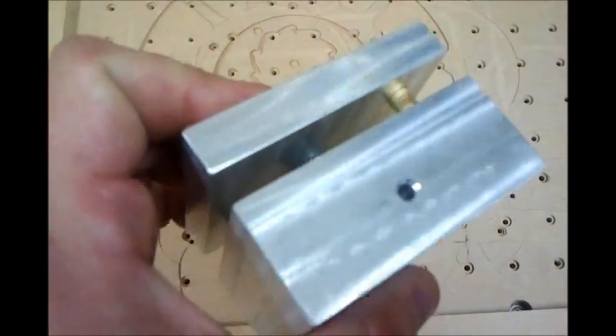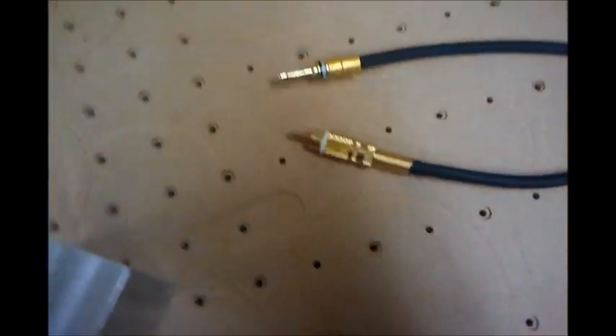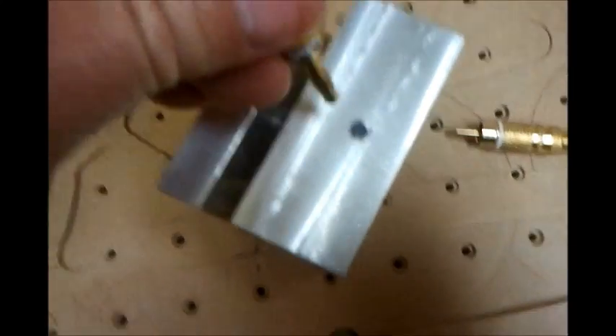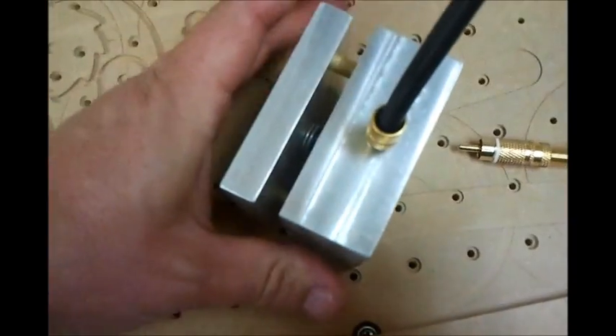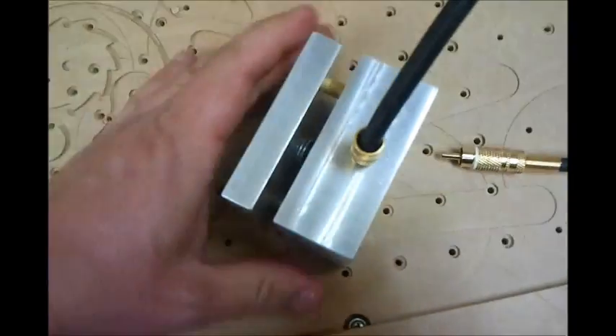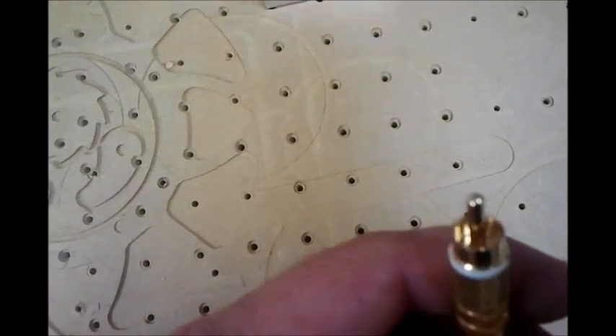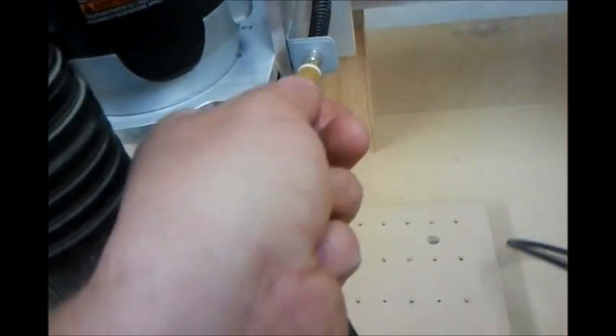It's got a hole on the side. I made up a special cord — on one side a banana plug plugs straight into a round hole, which is a nice easy removable connection. On the other side it's a standard RCA plug. I mounted an RCA jack on my router and just slip that in.